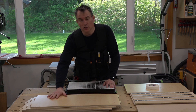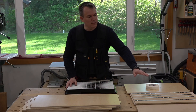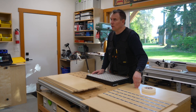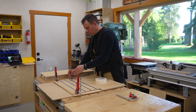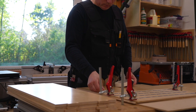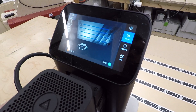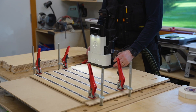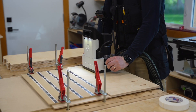I've completed four shelves with two tenons on either side using my Shaper Origin and workstation. Now I've got to set up a tape board with a sacrificial piece of MDF underneath so I can cut through my workpiece without damaging my workbench. Now I'm cutting the eight tenons into the side of the desk that will hold up the four shelves. Since the cutter leaves a round hole, I made sure to round the corners of the tenons so no extra cutting is needed. In this case I used a one-eighth or three millimeter radius to match my bit size.